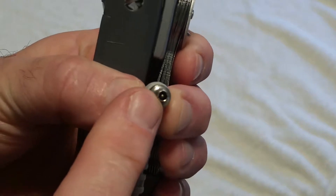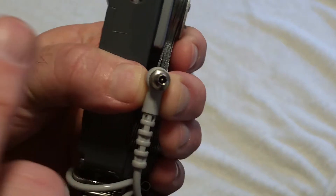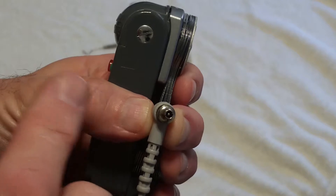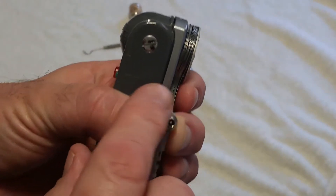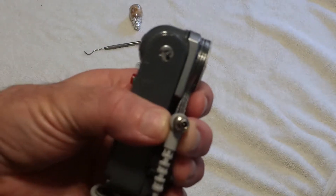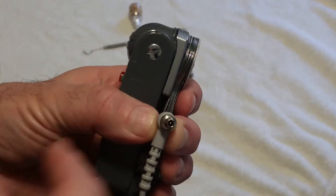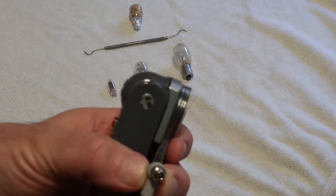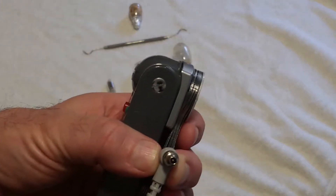There's a pin in the center of this connector and a shield surrounding it. In the original factory configuration of this unit, when the battery and capacitor are normally installed, the pin is negative and the surrounding shield is positive. Now in the days when it was made, it simply didn't matter whether it was negative pin and positive shield, or positive pin and negative shield, because the flash bulbs don't care about polarity, the unit doesn't care, and the cameras didn't care.